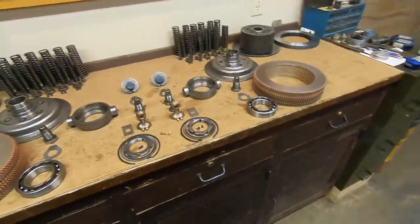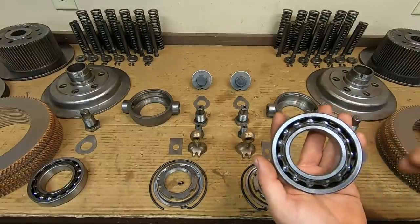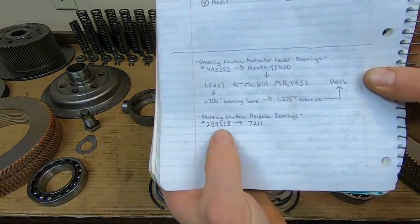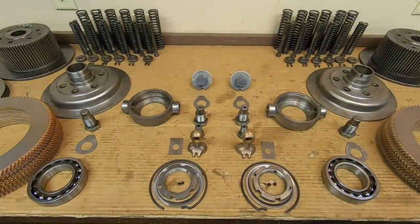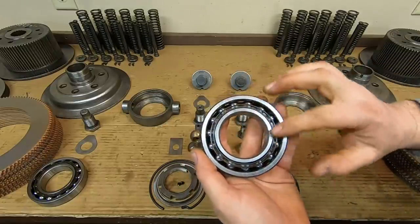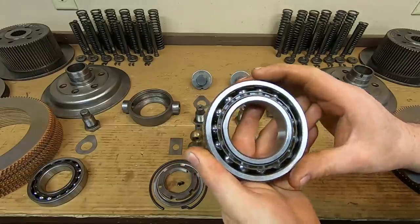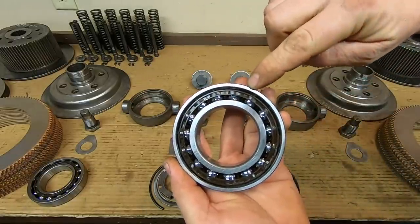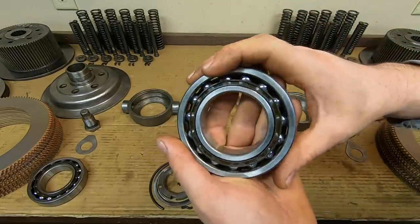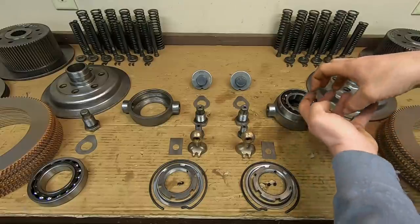Now we can begin with the assembly of the steering clutches. First thing we can do is put the new release bearings into the bearing cages. The CAT number for these was 2B9338, and they're just a standard 7211 thrust bearing — pretty common, you'll have no problem picking these up aftermarket. One thing to make sure of is assembling these in the cages properly, because there is a thrust face on the outer race and a thrust face on the inner race. The back side of the outer race is pretty much open with nothing really holding the balls in, so we know the thrust face of the outer race goes down into the bottom of the bearing cage — that's proper assembly. If you get that backwards, you're just going to pull that thrust bearing apart.